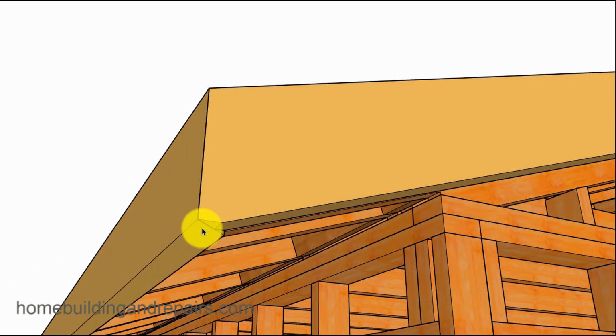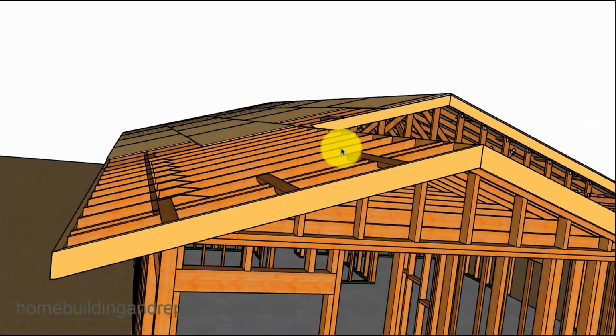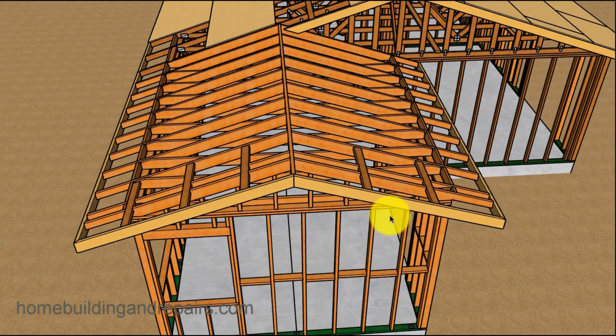And of course the bottom, it's not uncommon to have a bottom cut like this from the angle of the fascia board when you're coming into a horizontally level fascia board, and then you have one matching the roof pitch. Now I wanted to point out that I provided you with two different examples. Here we have a lookout that is at the bottom here, and here we moved it up a little bit.